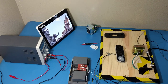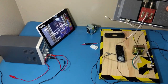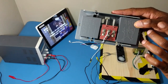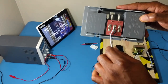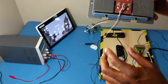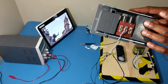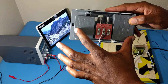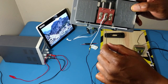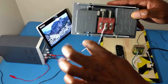If you don't have electrical experience, that's fine. When you open the mechanical chime, make sure you take a picture, because it has already been pre-installed in your house. When you take a picture, you know which cables are going where — you might have two red cables, two black cables, one red, one black. The professional electrician has already installed it. Before you change it out, take a picture so you know which cable goes to where, and mark the cables when you take them out. You have terminals labeled front, trans, and rear.